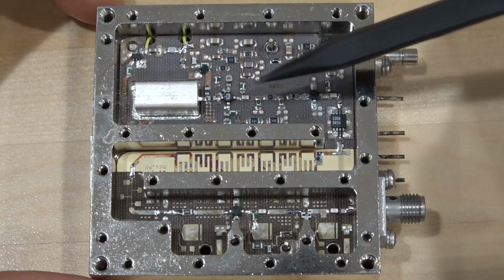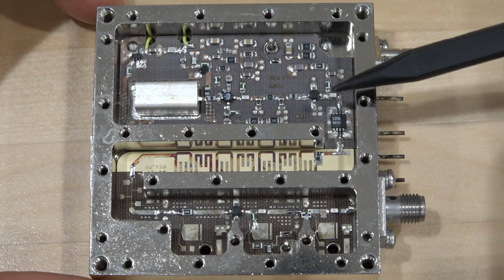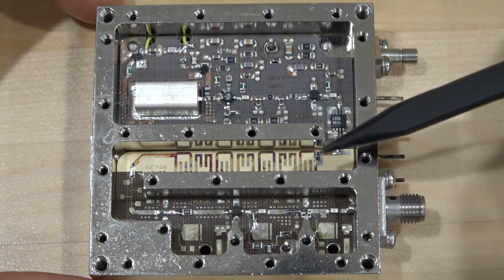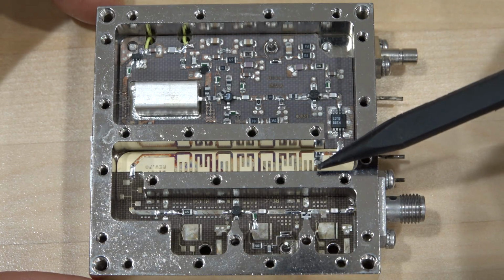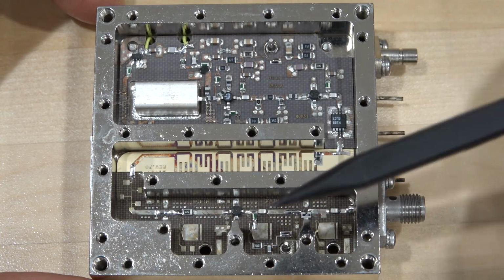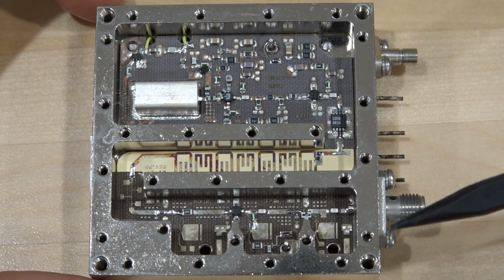And going forward, we see an amplifier here, and then this is a doubler from Hittite, which means that this entire section is working at 1.8 gigahertz, and that makes sense of why they have this filter afterwards, after the doubler, to create a nice clean tone from the doubled signal. So filter coming out of here somewhere, LC stubs, and they have 3 sections, 1, 2, and 3, which they can populate as they wish.